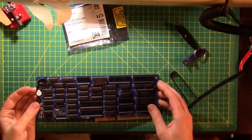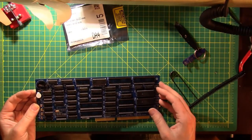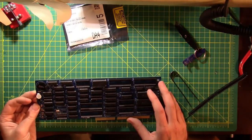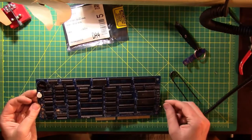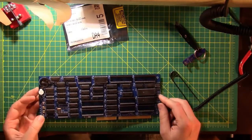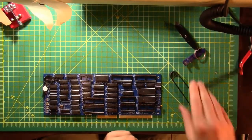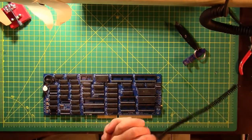Okay. So there's a couple of chips missing still, which we need to order. And some of these were not really available over at Mouser, so I got to go out to eBay and get them. Some of them I haven't decided what I'm going to do yet. The 8088 processor versus the V20 from NEC. And some of these other sockets support that. As an example, your clock crystal down here changes out depending on what speed of processor you put in. So I'm going to order them up, and then we will put that into an upcoming video.